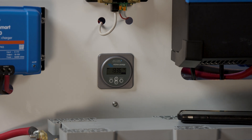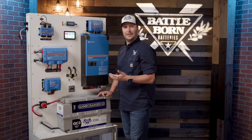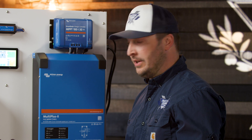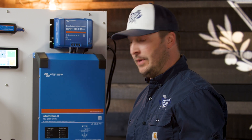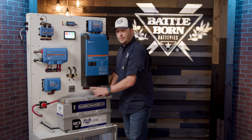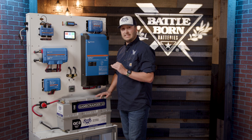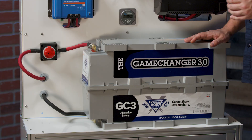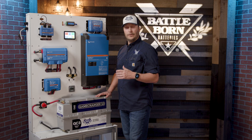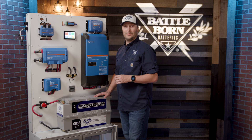The most common problems we see with the BMV are Bluetooth issues, and it's usually not the device — it's us figuring out how to use the phone. Download the Victron Connect app first, open it up, and get it ready before you have power connected. The device does need battery power to function and appear. If you're not seeing it right away, make sure Bluetooth is on, then open and close the app a time or two. When it shows up, enter the standard code of six zeros to pair with any Victron device for the first time. Feel free to call Battleborn Batteries if you have any questions.